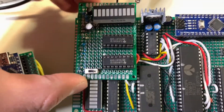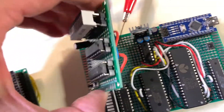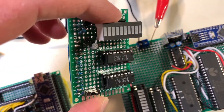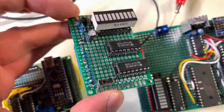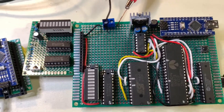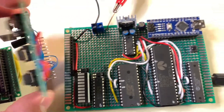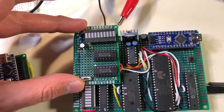On here I have a daughter board, or expansion board, which at this point is just two 4-bit registers and an LED bar. It has two different modes. There's a switch here to select between either showing the data that's currently being written by any device on the bus, or it can be flipped to the other mode which allows it to be addressed as a specific device. It has its own memory-mapped address at that point and can be operated normally.